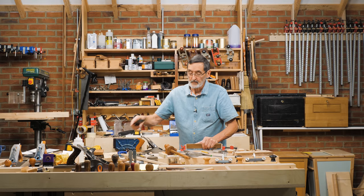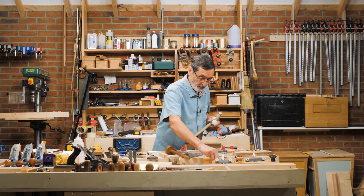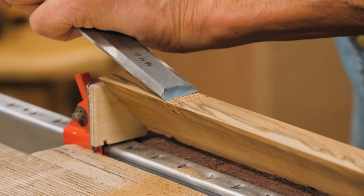Big chisel — take the top off. That first part there is likely to break off and it won't matter. I'm going down towards the inside corner, keeping it flat on this side of the sole. I'm almost down into the corner. Little challenge this, but it's good.